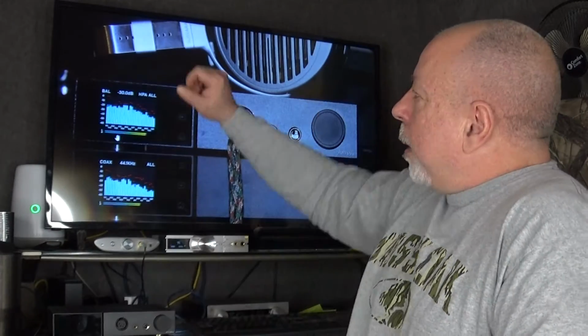So the power, that's the really strong point of this amp. This thing has outstanding power. Like I said, 10 watts per channel into 32 ohms. And if you can see in the picture here, you can catch the bottom of the Hi-Fi-Man Sundara, which is known to be one of the hardest to drive, most power-hungry headphones you can buy. And this thing has plenty of power for the Sundara. No problem whatsoever. I mean, you can take the Sundara to volumes that you can't listen to. It's just too loud without losing any sound quality. In fact, the louder you get, the better that headphone sounds.